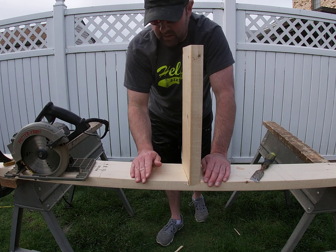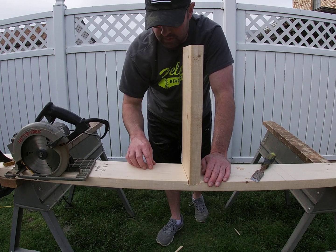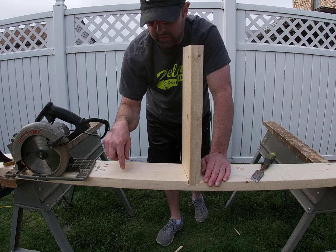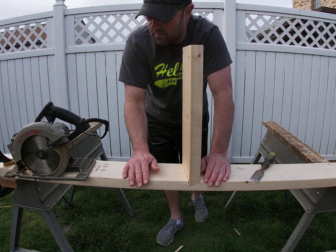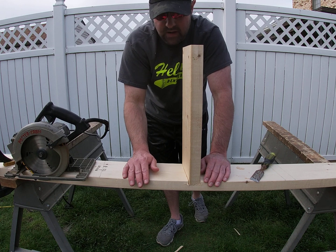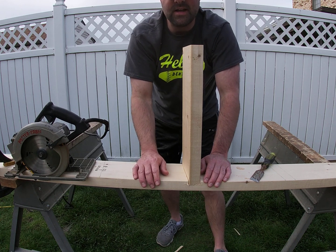So that's how you can slot something out with a circular saw by making several passes and cleaning it up with a chisel. In my next video I'm going to make some hand holes that I'm going to drill through with something called a hole saw, and that'll complete the series of videos on this ladder. I hope this video finds you well — I'll see you tomorrow.